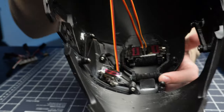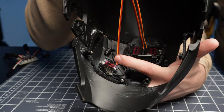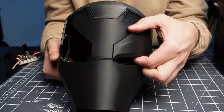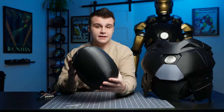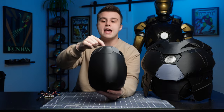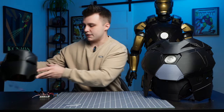I repurposed Levi 3D's ear motorization for the Mark 3 through 6. There's a hinge here which attaches to an arm which attaches to the servo, and then up here there's another hinge which attaches to the faceplate and to the eyebrow plate that I sliced off. What you end up with is this eyebrow piece that is motorized and it opens and closes just like that. It's not the most elegant solution but it works. The only thing that's going to need considerable modifications is the inner eye piece — I'll have to slice it into two individual parts and cut away the top so it doesn't hit the servo arm. If this faceplate mechanism ends up working I'm definitely making a separate video on it.